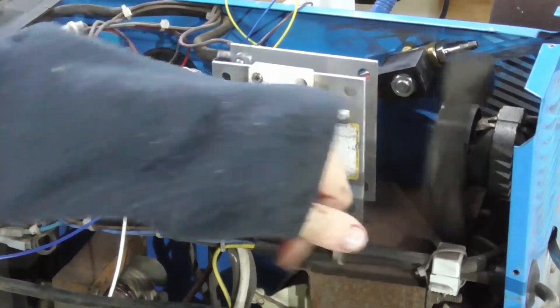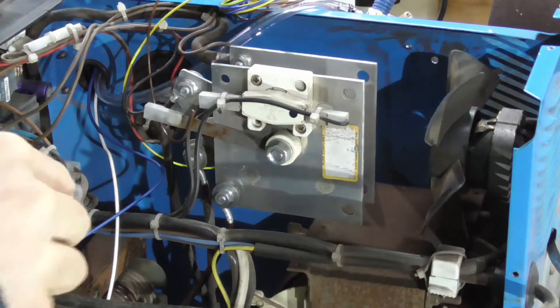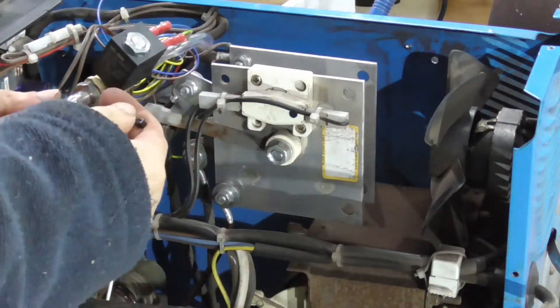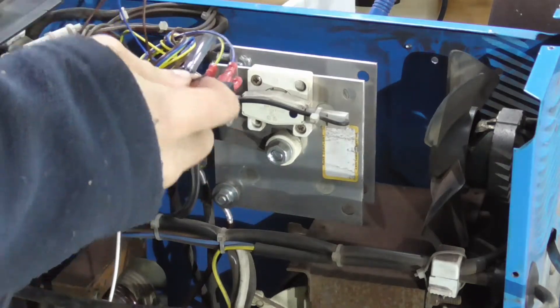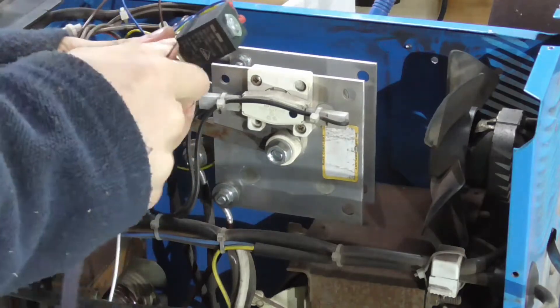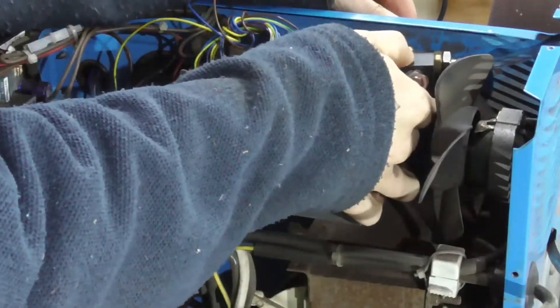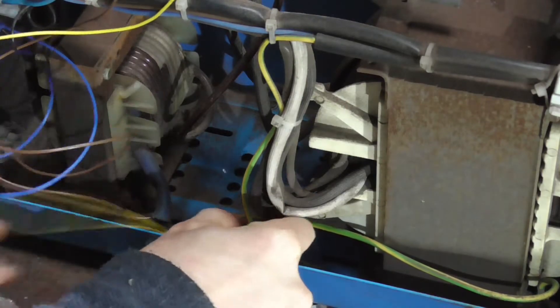It's going at an angle so it misses the fan. Put the hose on before you bolt it to the case. I find cable ties are perfectly adequate to hold pipes like this on — it's not like it's under any real amount of pressure. The solenoid valve comes with an earth lead and the welder has an earth post, so those two marry up quite well.